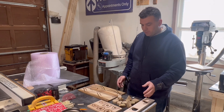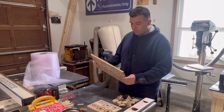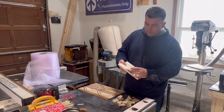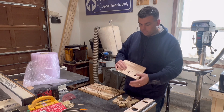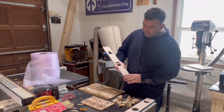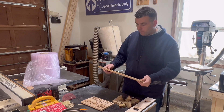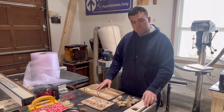All components are off the machine with no major issues. Now it's time to remove the tabs holding pieces in place. For the shape middles, I'll run them through the drum sander to remove the last onion skin so they pop out easier. I also need to cut the side panels into six-inch lengths to fit into the covers, and I'll round over the edges of the top and bottom covers using a round-over bit. After that, sand to the desired grit and we can start finishing.